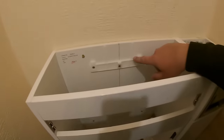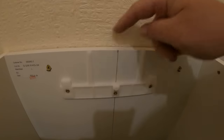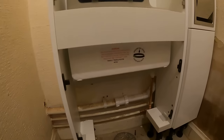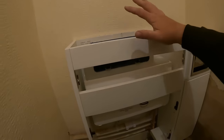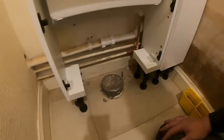I've unpacked it all and just hung the bracket. With these Roper Rhodes ones, they've got two little splints that sit at the top — you put that on the very top of the unit and then that's automatically the depth the system needs to sit at. Also with the backing on this unit, we know the bottom's not going to go anywhere. The Roper Rhodes concealed systems are always quite handy like that. That concealed system is in — now I'll get the pan, offer it into position, get the flush pipe cut to the right length, and then we've got a flexi pan connector to go on here.